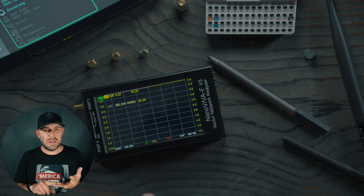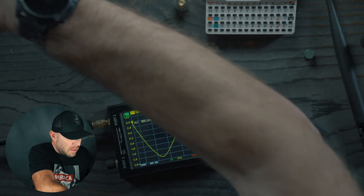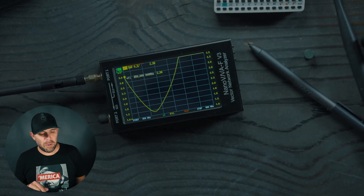I want to start with the 868 antenna. The Nano VNA has the appropriate SMA female, so I do have to use an adapter to go from the SMA RP to the SMA male. I couldn't calibrate with this adapter on because I don't have a conversion for that, but we'll go with it. You can see a pretty decent little curve here at the bottom. I want to minimize interference — just my hand being in the way is causing some. Orientation of the antennas also matters, as you can see the V on the graph goes up or down depending on orientation.